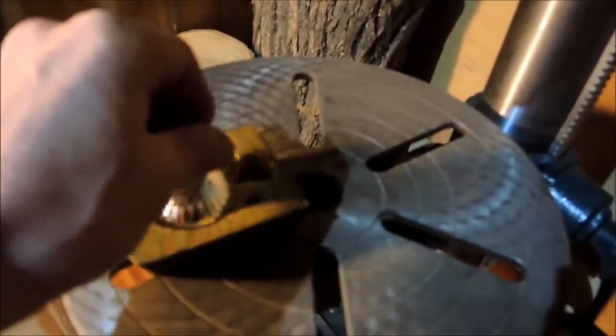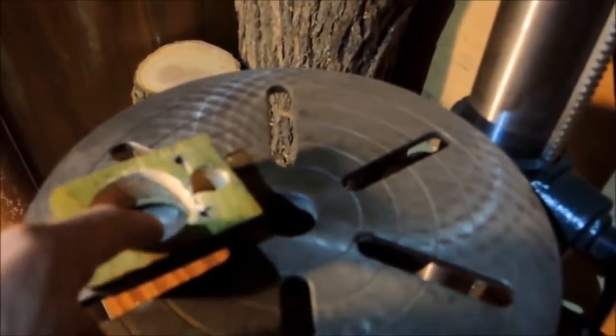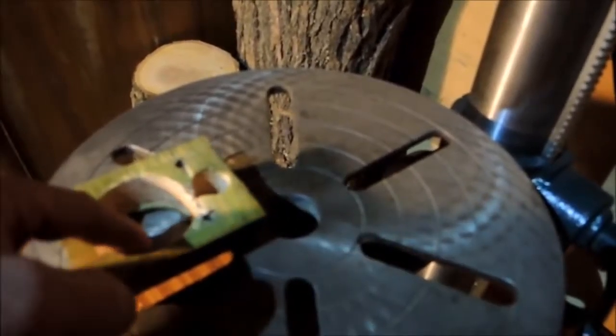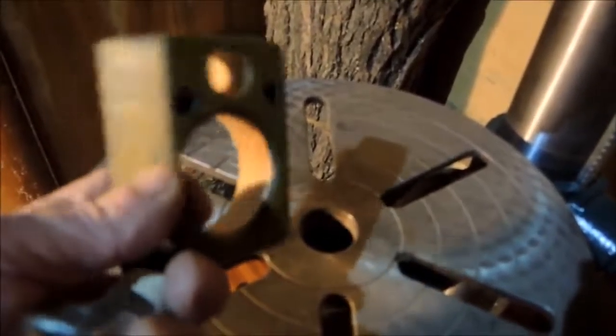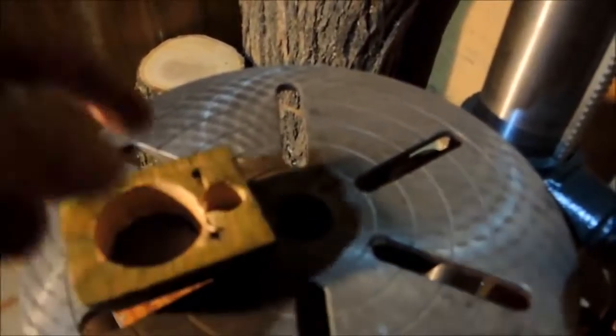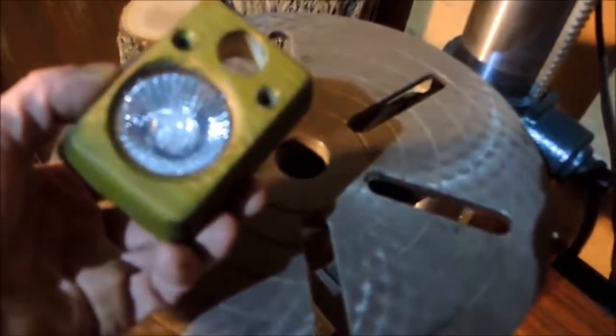And I bought just this light, and I put it like this inside. First, I make here a 50 millimeter hole, but not through. I just leave 3-4 millimeters here, and then I make the hole through. Of course, on this drill table, I make this 44 millimeters, and now I just put the light there like this.